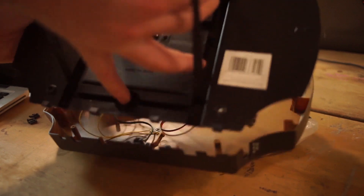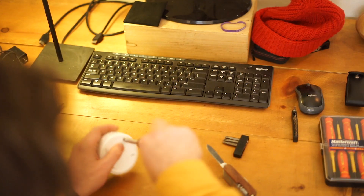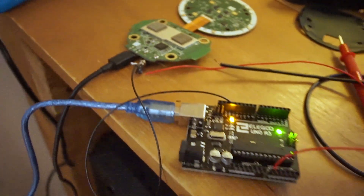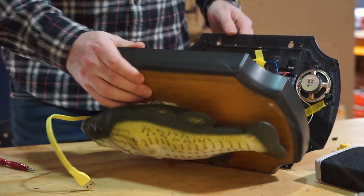So how did I do this? I took Big Mouth Billy Bass and took it apart. There are three motors in there used to animate the tail, the mouth, and the head. I attached those to an Arduino motor shield to drive each one of those DC motors independently. Then I took an Echo Dot, tore it down, and took the line out 3.5 millimeter audio signal and pulled one signal off of that — the positive signal — into the Arduino analog sensor. I just read that to see if any music or audio is coming out of the dot, and if it is, I drive the motor shield driver. The way that we pull the signal from the audio will actually work with anything that has a 3.5 millimeter audio jack as well, so if you want to plug this into an iPod, you'll be able to get Billy Bass moving to whatever your source of audio is.